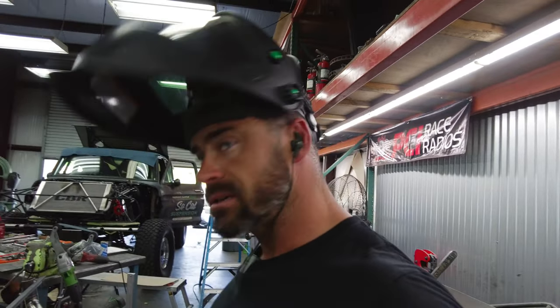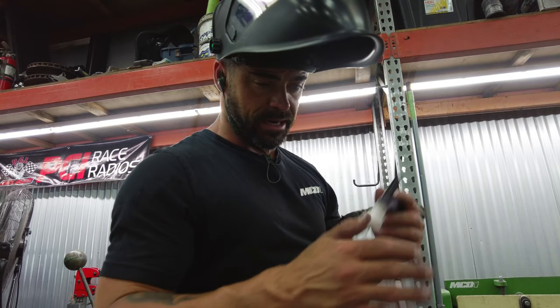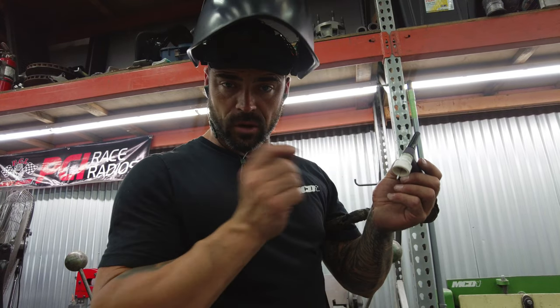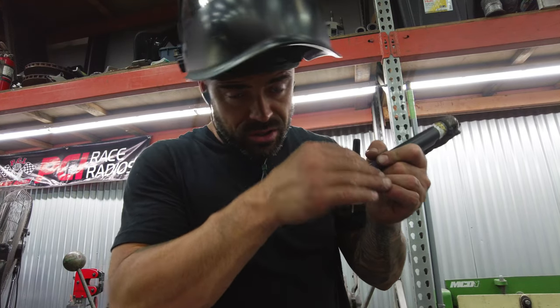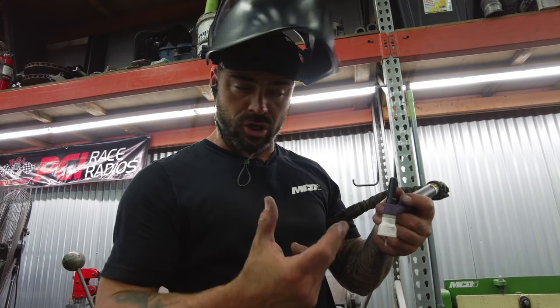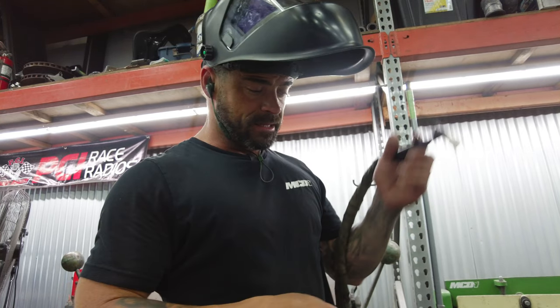So one part I do want to touch on still is the caps. The caps are always tricky. All these that we're going to look at right now, I have used rod on, but sometimes I will, if I know there's enough filler material already on the root and it's not sanded down or something, hold the torch and fusion right over the end caps. If it's not a structural piece and I know there's nothing that's going to tie into making it fail,